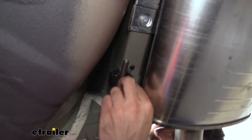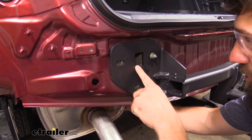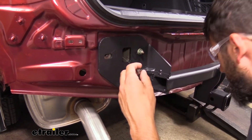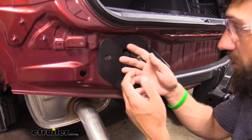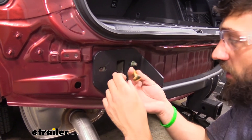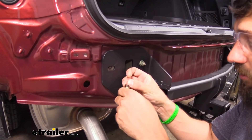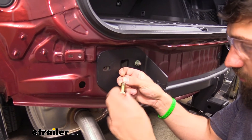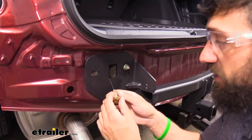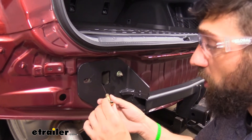Now I'm going to take the coiled end of our fishwire and place it through the hole that we want our bolt to come through. Here's our access hole — I'm going to take the fishwire, the coiled end, and pull it out through the access hole. You want to make sure you don't pull it too far because we obviously don't want to pull through the other side of our fishwire. Then I'm going to hold on to the fishwire and carefully thread on our carriage bolt, threading that all the way on. If your particular one uses a spacer block, you want to go ahead and place that over the coiled end before you put on the carriage bolt.